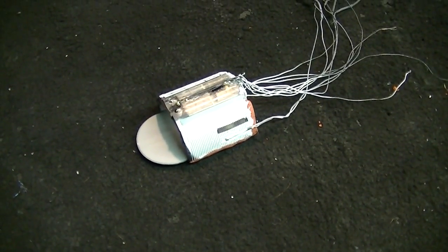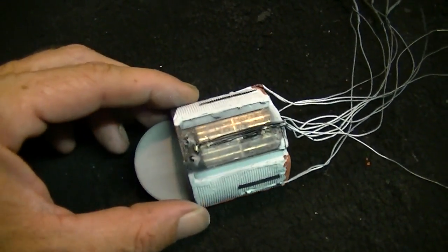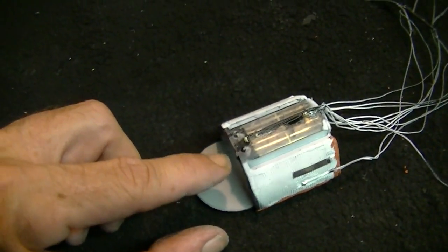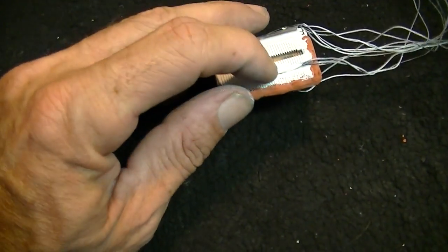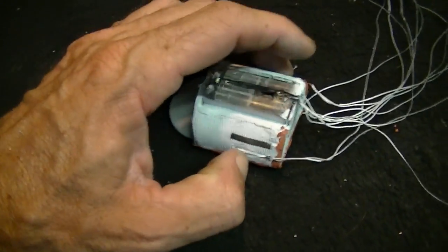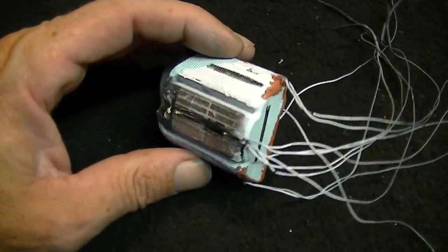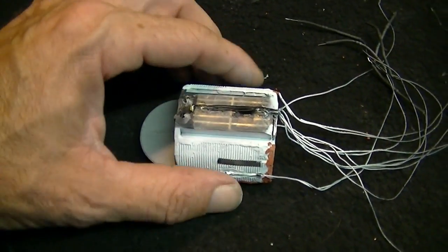What you see in front of you here today is the completed shuttle bay. I've gone back now and done all my light blocking on this and installed the rest of my lighting. I've got another SMD that I added at the rear, which will be directly above the shuttle bay doors for that little lighted pod area on the back of the ship. I've got two SMDs for the ceiling lighting, and I've added one more on each side to light the side windows and the exterior windows at the rear. I painted the outside of this white so that will reflect our light around in here and get all our external windows lit.